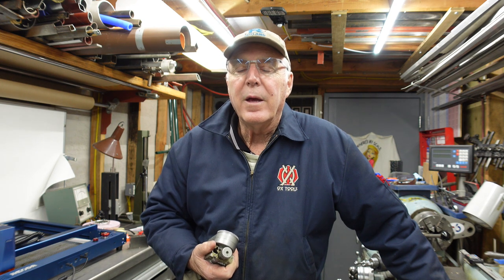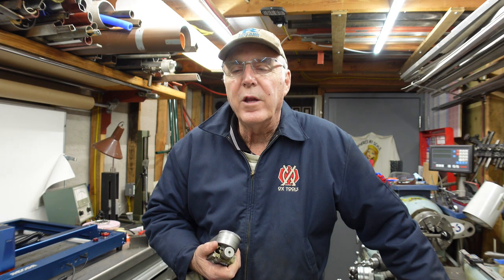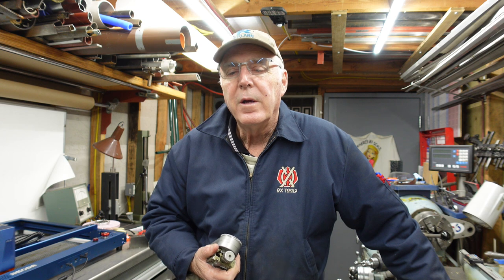So that hayman is for a YouTube buddy. He called me up and said he needed to get it done and asked if I could help. It was four pieces, nine inches long, a three-sixteenths inch wide slot, three-eighths inch deep on both edges of a half-inch bar. So it was just back and forth — taking a hundred thousandths depth cut on each pass. I was running a little conservative at first at a thousand RPM and kicked it up to 1700. Carbide doesn't mind speed and I just motored them out.